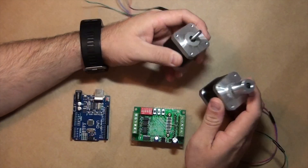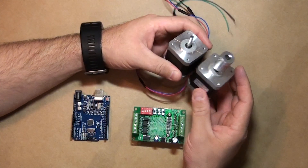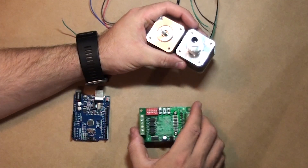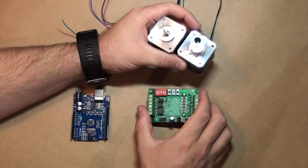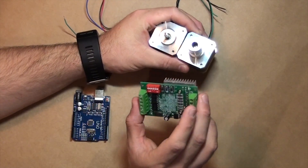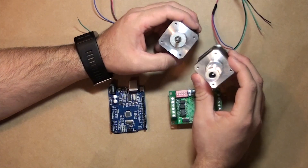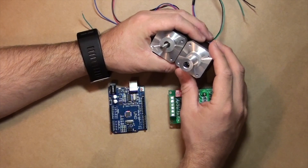These are the motors I used the first time on my CNC. They were a bit too small. I found out that this maybe would have been big enough if I had used the TB6560 in the first place. I am driving all my four stepper motors across three axes, with two stepper motors on the X axis.